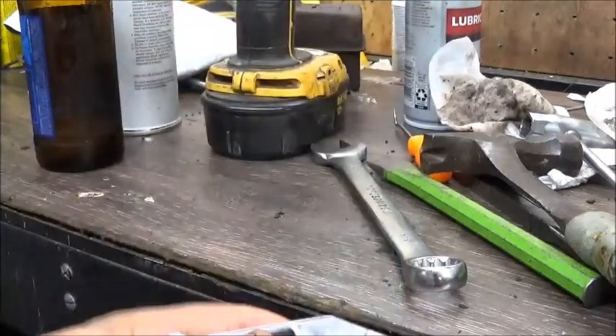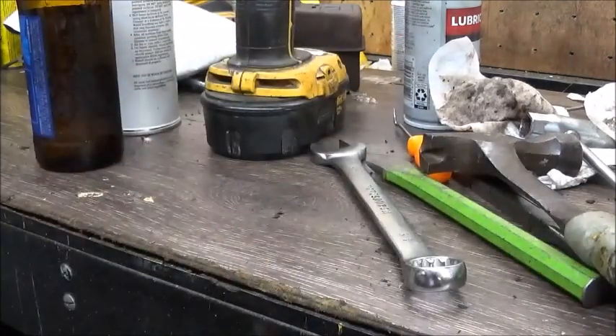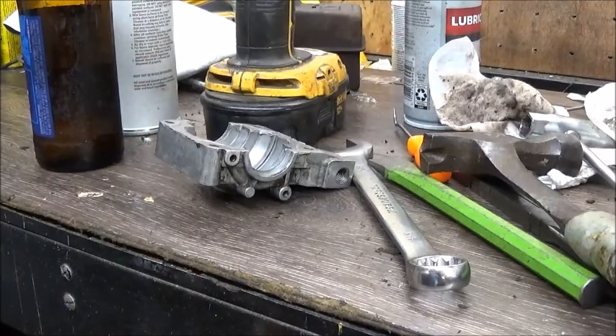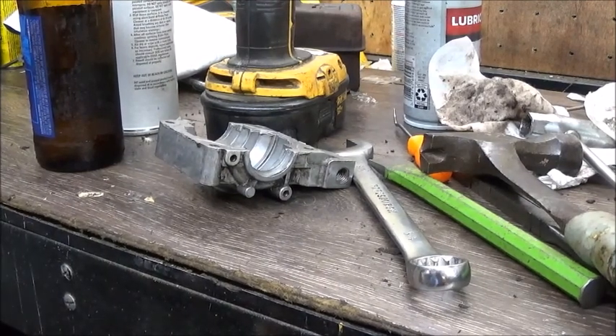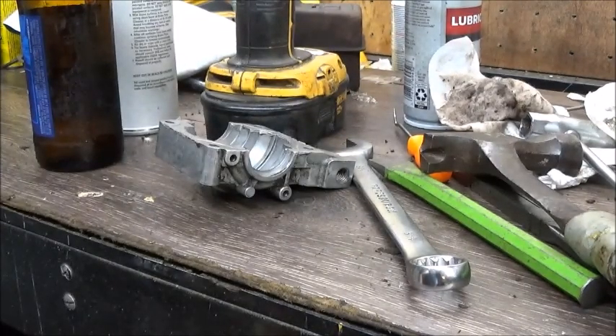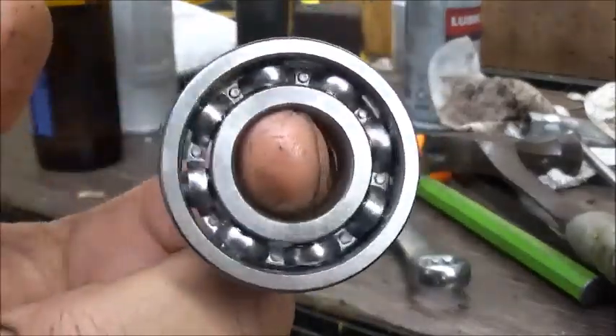You do need to remove your bar stud closest to the clutch because it does go into that. I think that's a lot of the reason these saws are so tough — all of the AV bushings and the fact that one of the studs does indeed go into the engine. These are the new bearings; I've already got the old ones off, just took a punch and drove them off with a hammer.